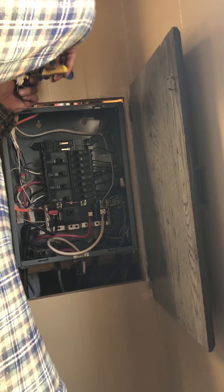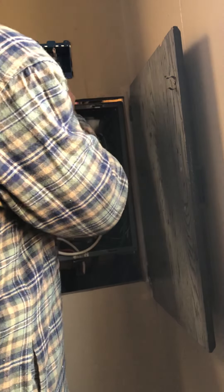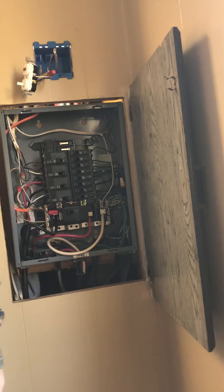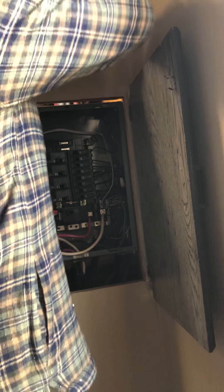Always run your J hooks on your wires. I don't use those push-in tabs or push-in slots on the back of a switch. You'll see a bunch of holes on the back of a receptacle or a switch — I don't use those, because they only hold 14 gauge wire. You try to stick a 12 gauge in there and it won't go.